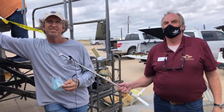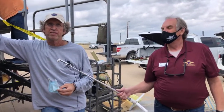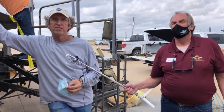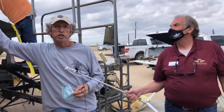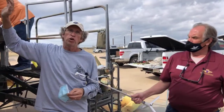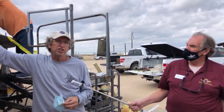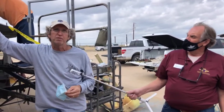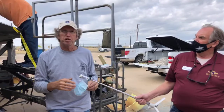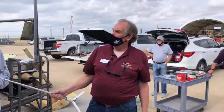This is like airplane number 29 here, so it's not like this is our first airframe. We've done a lot of different restorations, but we haven't had access to the resources you guys have. Say a little about having access to people who actually did the work at the factory. Just doing this cold, somebody off the street trying to do this, it would have been a mess. It's basic airframe skills in terms of how you put in rivets and get things lined up, but knowing which piece has to overlap which way — having Smitty, who has literally been there and done this, was just priceless.